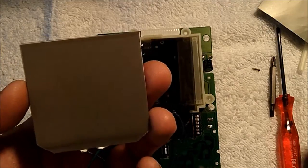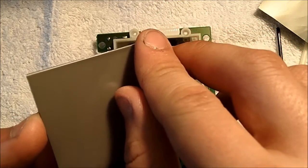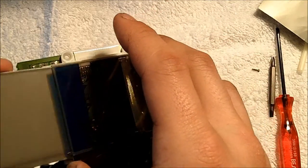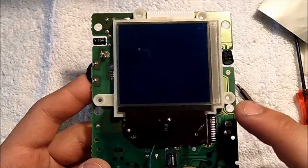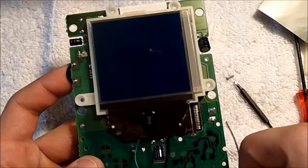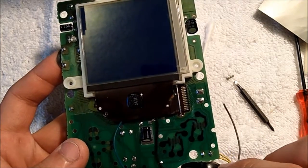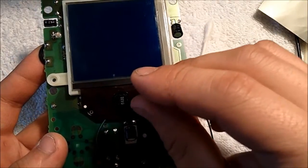The polarization film on the backlight is inverted because we are doing a bi-version — I'll explain more in part 3. Peel off the protective film from the front of the backlight and make sure there is no dust as you slide it behind the screen. Then screw in the Phillips head screws at the bottom of the LCD panel, making sure the colored wire is sticking out on the left side and the black wire on the right side. Be very careful with these screws as they are very easy to strip out.